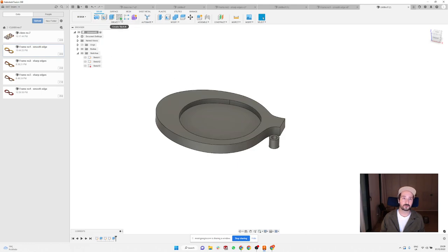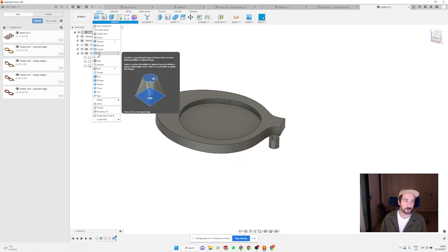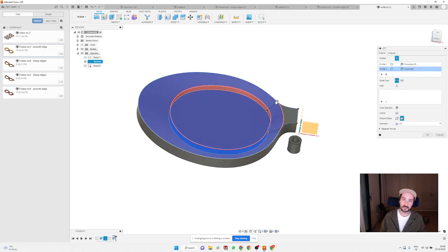And now we're gonna go to the operation that is called loft. Loft means that I'm gonna extrude one shape into another one. In this operation, I'm gonna press plus, and select that one of the shapes I wanna extrude into is gonna be the lens, and the other one I need to turn on is this sketch that we created before with that little line. Here it's this one, and then the second profile is gonna be this. So I just click on that sketch on the top, and you can see now that these lines are showing me that there's gonna be a slope.